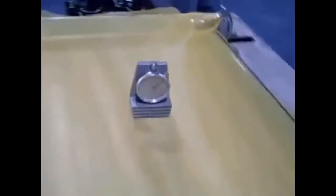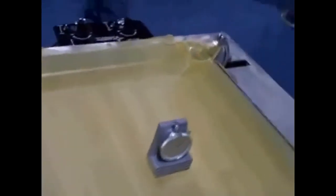If I put the meter on like this, it's measuring the tension lengthwise, following along the mesh. And I'll get a whole different reading if I turn it like this — I'll be able to measure my tension going across. So ideally, we want it to be within plus or minus two Newtons of being the same in both directions. That's a very accurate meter.